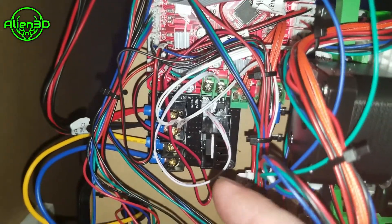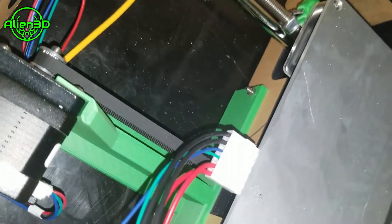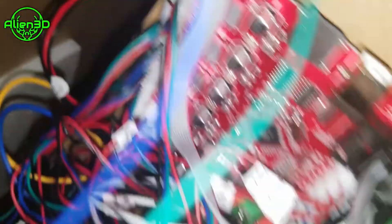For the people who do not have the six wire systems, I highly suggest going to a six wire setup. Some people solder the wires to the bed, and some people just buy different fittings so you can detach and still reattach your wires. If you solder the wires to the bed it makes it hard to perform maintenance because you have no way to disconnect the wires. If you're going to upgrade to the six wire system or replace the wires to your hotbed, I personally use 14 gauge — some people say 16 gauge is good — but make sure you get the silicone sheathed wire because it's more heat resistant.